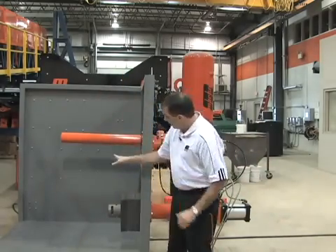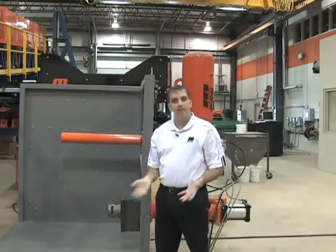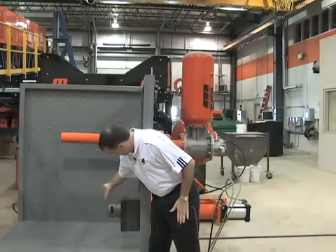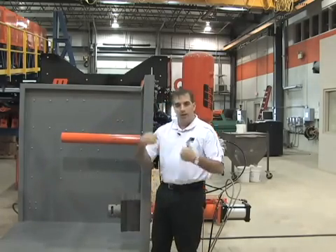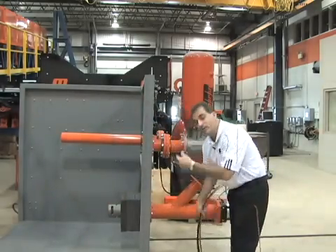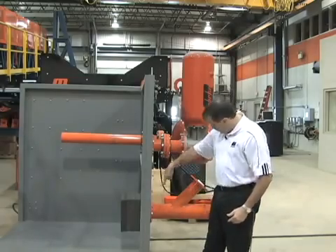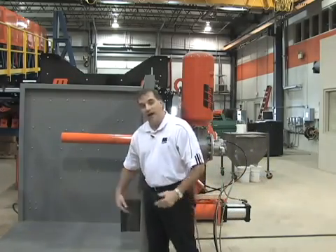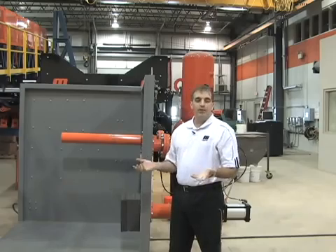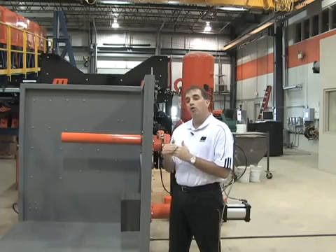It's a pretty nice blast pattern. On larger walls in those hard-to-reach areas, we've had customers put two or three in line to clean that area, thus reducing the need for high-pressure carbon dioxide blasting. Since the nozzle has protruded out past the refractory when the cannon blasts, you won't break away that refractory material against the wall. Now in its retracted state after it blasts, the signal from the solenoid sends air back, retracts the nozzle, and now it's protected — recessed about 50 millimeters inside that refractory — keeping it from being exposed to the heat.